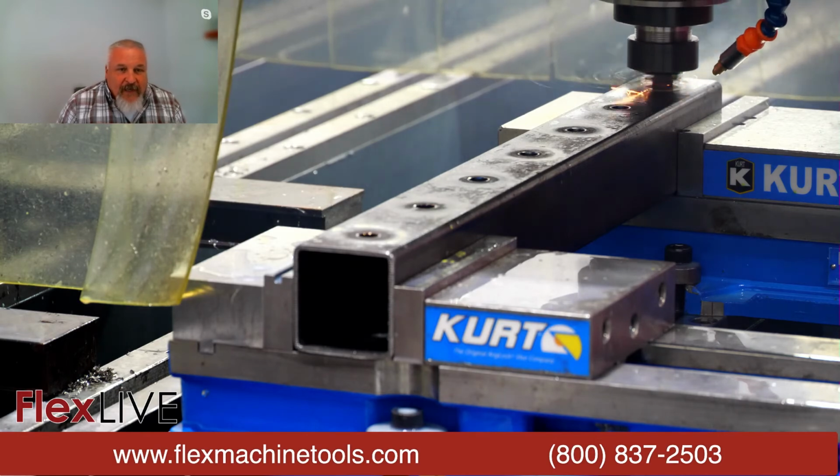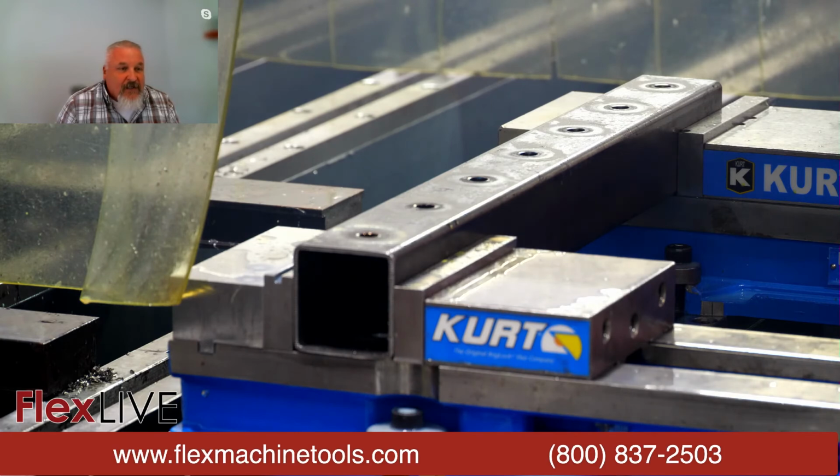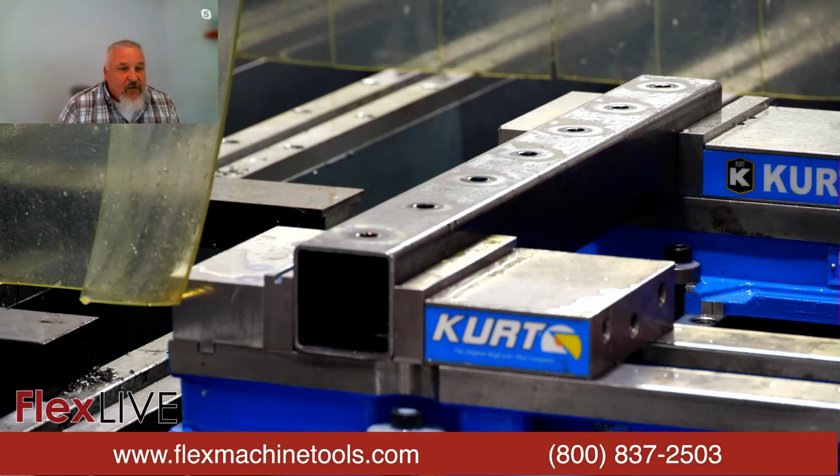Well, the flow drill makes contact. It's based on friction. So as that friction heats the material, it softens it, much like an annealing operation. And then as it softens that material, it allows it to flow, and the bit shaves the top off. So that's causing a chip. That's the only time in the flow drill process that we will create a chip for you, is if we use this type of flow drill bit and it shaves that top upflow material away. All the other processes that we have, all the other bits will create no chips whatsoever.